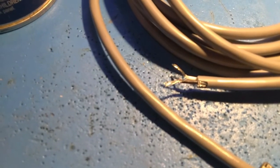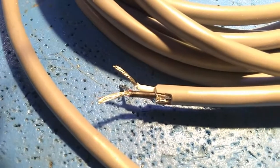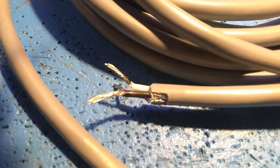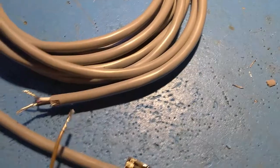We've got the other three wires that we need to put a connector on, and if you look inside the shielded cable you can see there's also foil around it. We need to solder a ground wire there to send interference to ground. I'm going to take a jumper wire — I like to use ones whose heads have come off — and solder it right to that shield.